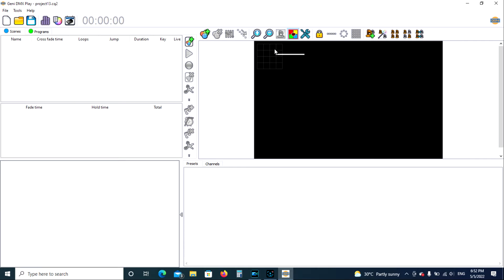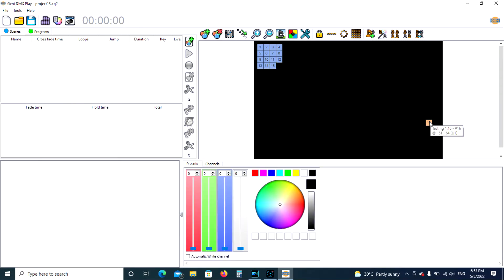Select okay twice and there are all our blocks — our 16 channels. We can toggle the four colored boxes up top to get more detail on what channels are where. It's important when we lay these blocks out that we position them to represent the way the channels are on the building. In this case, channel 16 is way down here, so we just drag these LED fixtures out and spread them out enough to select them with ease later.